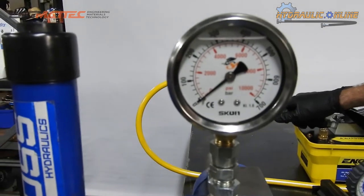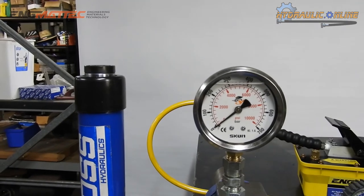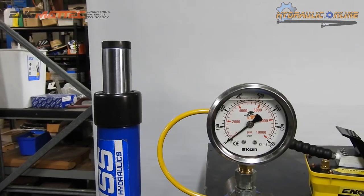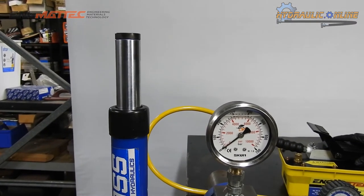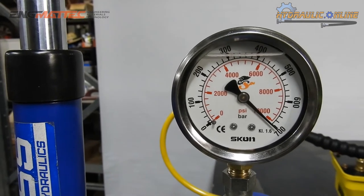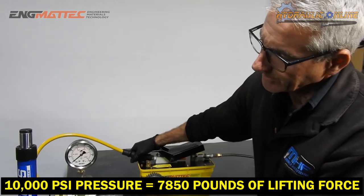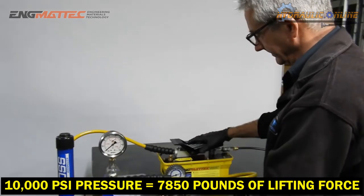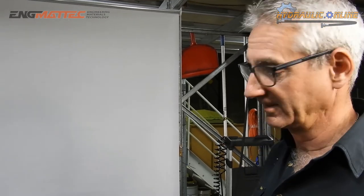Let's see what happens at 100 psi — which is the recommended maximum supply pressure. The air regulator is having a little bit of wind. With 100 psi of air pressure, we've actually pegged the scale — we've gone over 10,000 psi. I'm going to reduce the pressure first, and then with 100 psi we'll watch what happens. Nothing happens until the cylinder hits its extent, and then you'll see it build. I can actually control the speed by how hard I press on the regulator — it's almost like an accelerator pedal. And there we go — that was what Riley was trying to film himself doing last week.